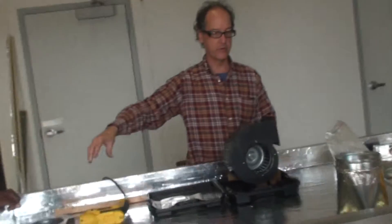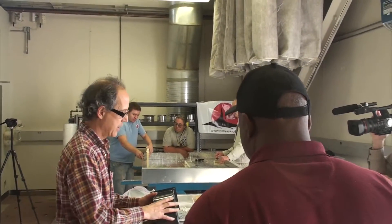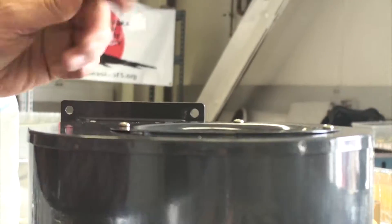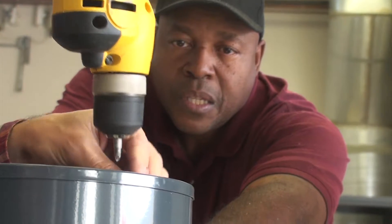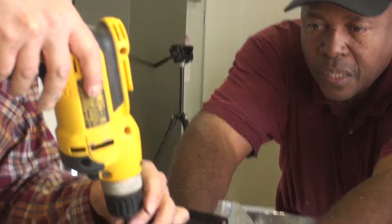The sizing of the blower is a little bit more art than science, because it depends on how many feet of flex duct creates static pressure, how many turns you have in your duct that creates static pressure — all those factors weigh in. Then the airflow of your collector itself is part of the equation. I just start with this size because it's right in the middle of what you need. If the thing's cycling on and off during a full sun day, then the blower's too big. What we're going to do is take the inside rim off so we can prepare it to accept a piece of flex duct. Once you've got this rim off, the air will flow nicely into the collector with less turbulence — you want turbulence inside the collector; that's the only place you want turbulence. Everything else you want smooth.